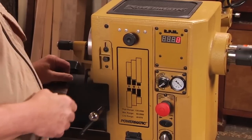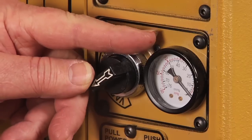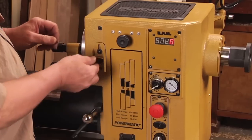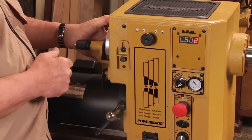We've added a vacuum chuck — a Venturi built into the headstock that allows you to connect your shop air directly to the machine and have vacuum. We've added a spindle lock. Nobody has a spindle lock like this. It's one of the best features of the machine. And with it now, you can put things on the chuck, take them off, without any assistance.